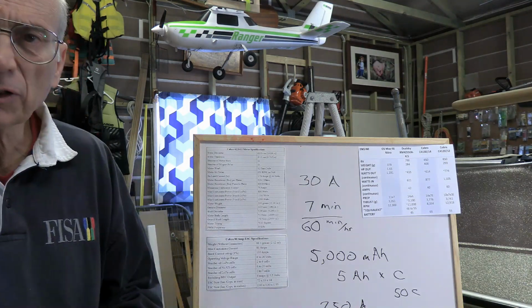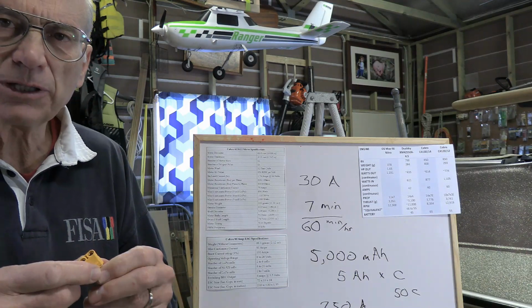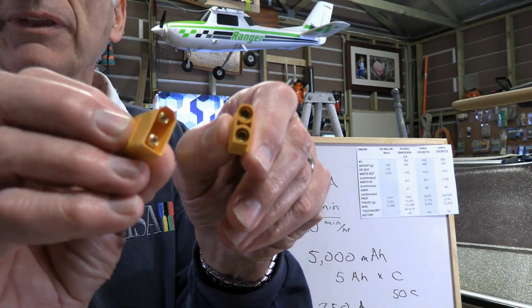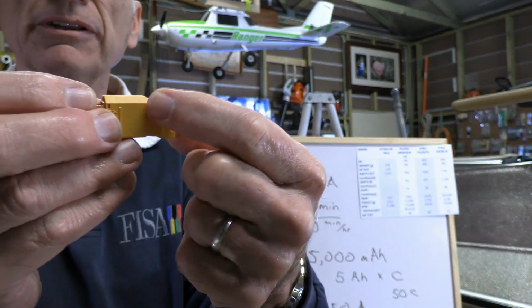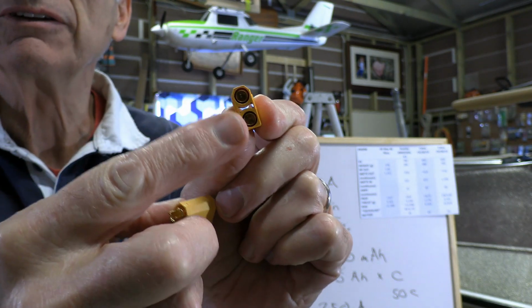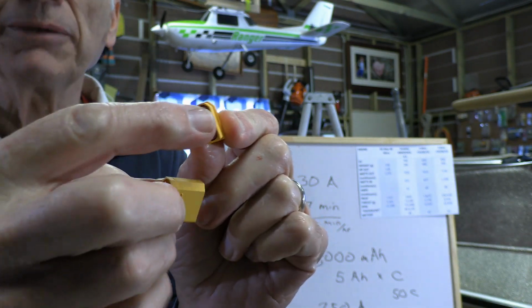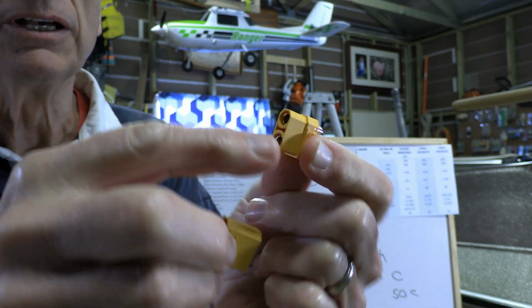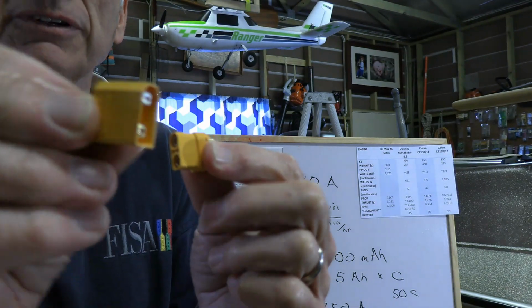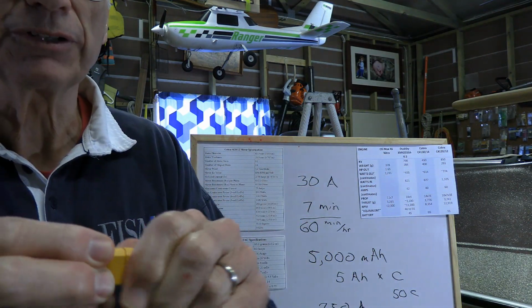As you think about the connectors, the one that's on the battery needs to be the safest one as far as not shorting on things, and that's going to be a female. Now the question is, what is a male and what is a female? Okay, so here we got a male and a female. Which one is which? Well, as far as the plastic bit, this one on this side is the one that is going inside the other, so you might think that that's the male, but as you look at the conductor inside, this is the one with the holes in it, and this is the one with the plugs that go inside. So in actual fact, it is the metal bit inside that's going to make the difference as to whether it's male or female. So the ones that got the holes in the conductor on the inside, that's the female. The one that has the solid plugs, or I guess not exactly solid, but the ones that go inside, that's the male. So they go together quite nicely.